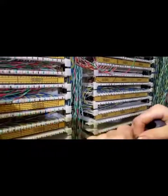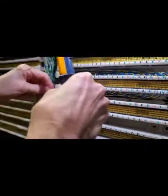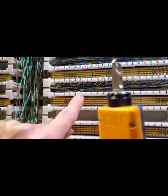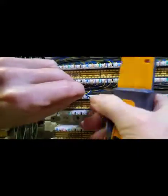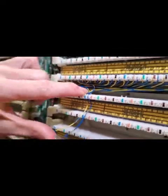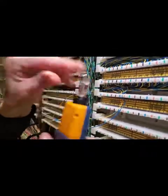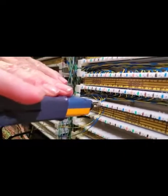This is the LEN — the address. We always find our group number and our port number. Bring our cross connect wire in. Make sure the tip goes first, in between. We're going to switch out our blades — switch from the 66 blade to the 110 blade. Check your cut side; you're cutting off the excess. You cut right in between here, both wires.